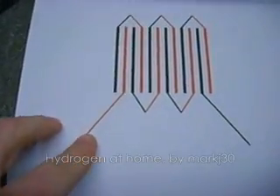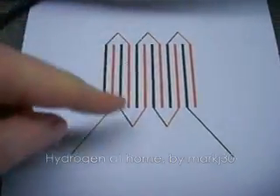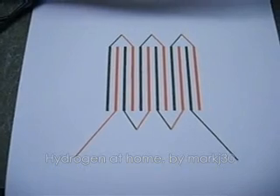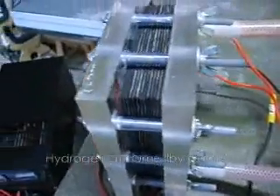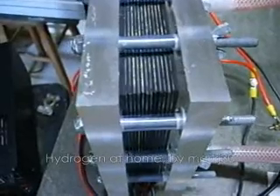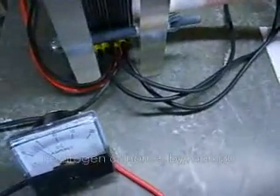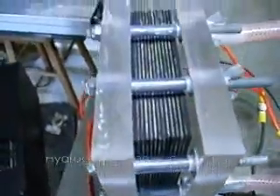This is how it's wired up. Obviously positive is coming in here and it can split off into two different directions, then it basically repeats a pattern through. It's basically dividing the voltage up by 3 — that's why I've got it set to 6.9 volts. I've gone through and tested this with the multimeter between each plate, and it's not very consistent. I know it's not all the plate's fault because it was a lot more consistent in its neutral plate configuration, so I'm betting it's the cables — they're not all the same length and a couple of them have got joiners in them. The connection on the plate itself where the cable goes on probably has to do with how consistent it is as well. Not a perfect test, but it's still something to try out.